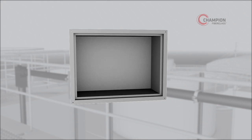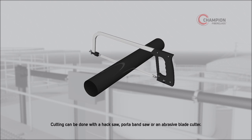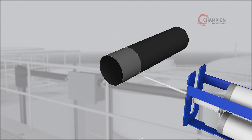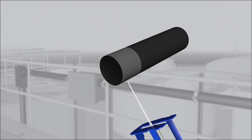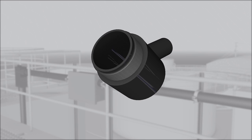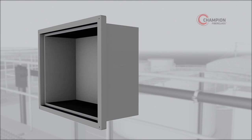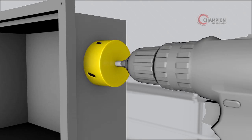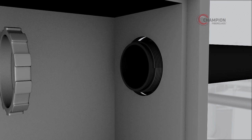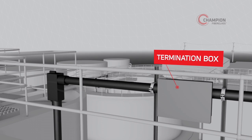We make it easy through our field cutting process. To prepare, make your initial cut. Prepare the ends by sanding them down to take out the gloss. Apply the Champion Epoxy Adhesive around the prepared ends. Apply the threaded terminal adapter by simply sliding it on — it will be the same as an end bell or a box connector. Make an appropriately sized hole inside the box. The terminal adapter then goes inside the termination box. And with easy field bending available, installations are that much more effective and simple.